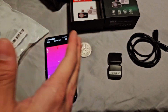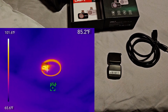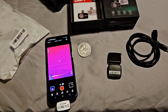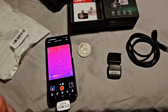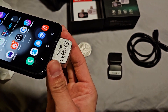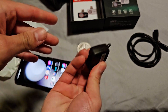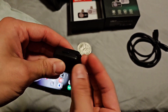This will allow you to find something that's shorting out — getting really hot but on the outside looks perfectly normal. From that picture I took earlier of my overhead light, you would never know by looking at that fixture that the LED driver chip is getting so much hotter than the surrounding area, because to your eyes it just looks like white light coming from an LED fixture. But clearly there is a lot of heat coming off that driver board, and that is going to be the first thing to fail. If you're working with electronics, building PCs, or something like that, finding hotspots is really important. And having something this compact — it fits in this little case, you can put it on a keychain, throw it in your bag. This takes up no space whatsoever, so there's no excuse not to have it with you.